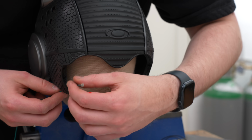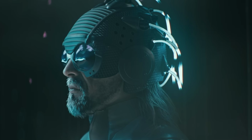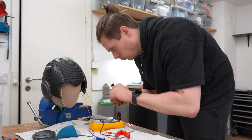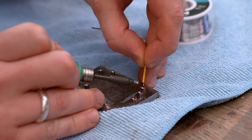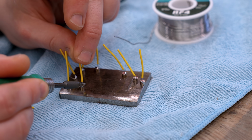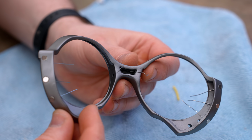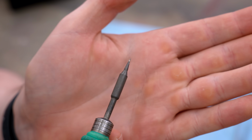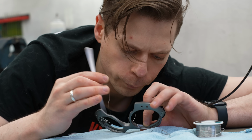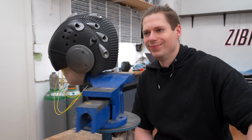I'm connecting the magnets to the controller, so when the goggle magnets close the circuit, it will trigger this startup waterfall animation. This will add a tiny bit of showmanship to putting on the goggles, and I'm thinking since it's Oakley, the eyewear part kinda needs to be emphasized. I went with 8 pairs of magnets because that seemed like the right amount to keep the frames firmly in place, and 8 should be enough to keep the circuit closed so the lights would just not start flashing randomly. Snaps and plays beautifully.